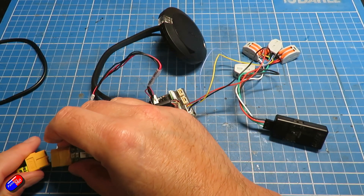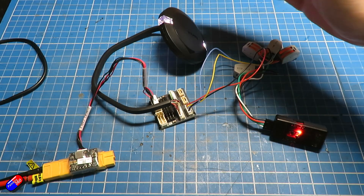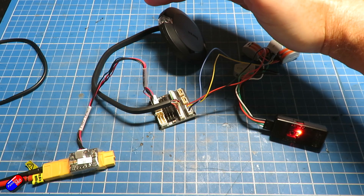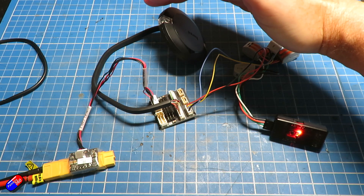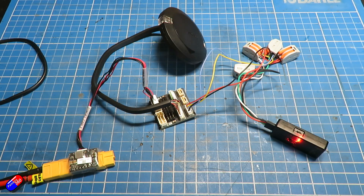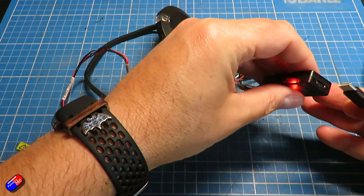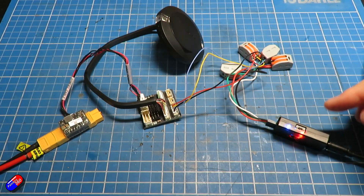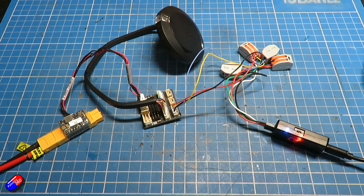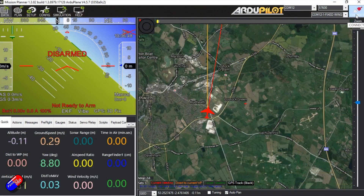Once you've got that done, you can connect to it via Mission Planner. Let me power it up — you'll see the GPS will do something weird because this is actually already flashed with ArduPilot. Once it's flashed, it'll immediately jump into its default stuff, and then I can plug a USB cable into the RadioMaster FTDI adapter and basically I'm talking to it as though it was any other kind of ArduPilot flight controller.